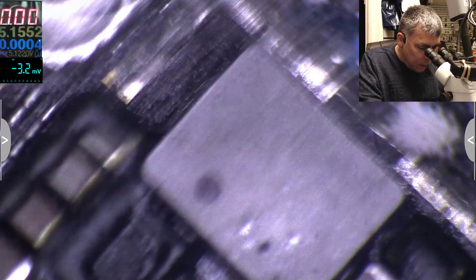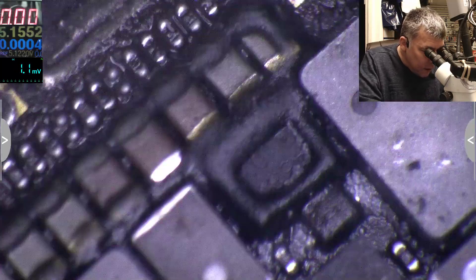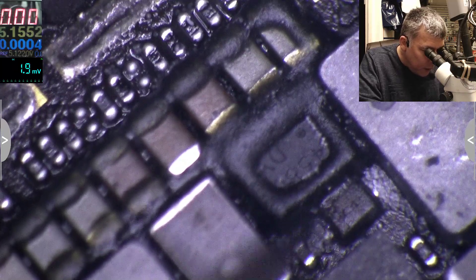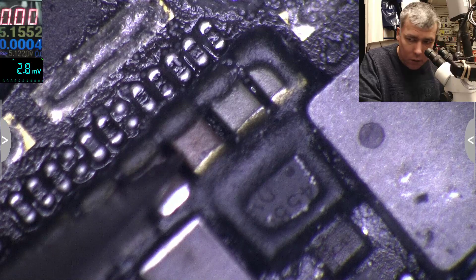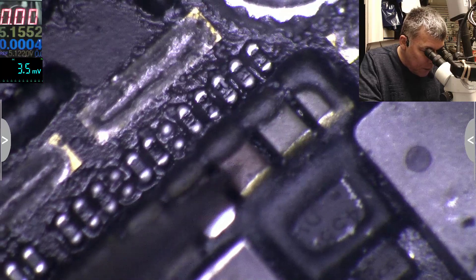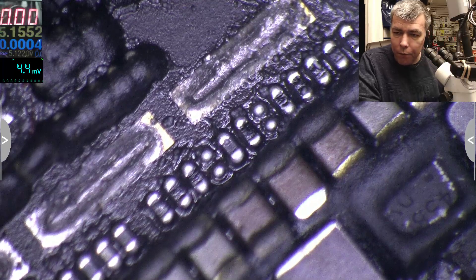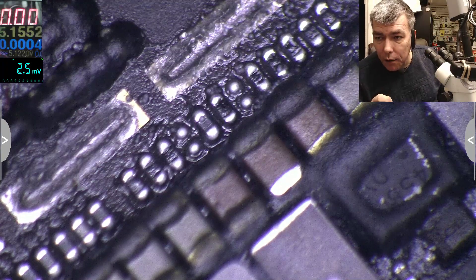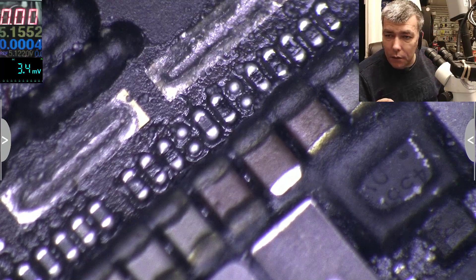Something is shorted, but it's not the IC. The IC is connected before the diode switching to ground. From the plus of the diode, we also have a few capacitors connected to ground — these brown ones. All three brown capacitors are brown for one reason: high capacity, high voltage — around 25 to 40 volts, I think 25.